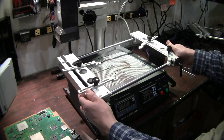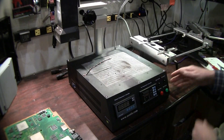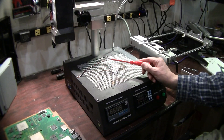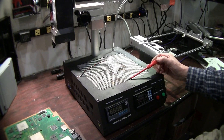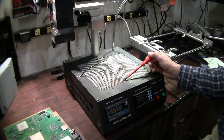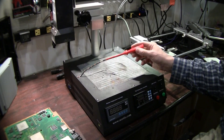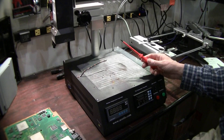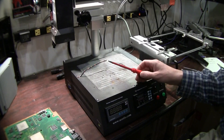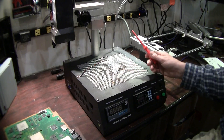Getting into this unit — the rack is a very nice rack, it's good for smaller boards, so you probably won't have too much trouble with that. The unit comes with a lower element probe that is mounted in the front of the unit, tight against the plates. I believe that's where it was originally, because that's where we moved it from when we got it, but the previous user had pulled it out and done a similar attachment with it. It is possible that what caused it to overheat is the probe was not close enough to the plates and therefore didn't register the plate temperature, so the plates heated up until they got red hot and just started melting stuff inside the cabinet.